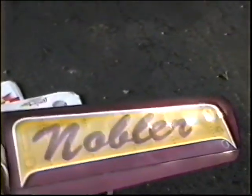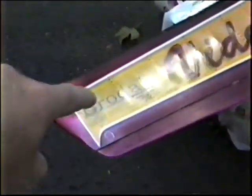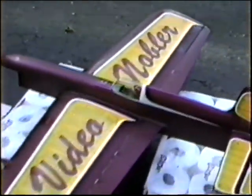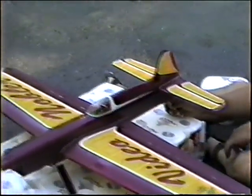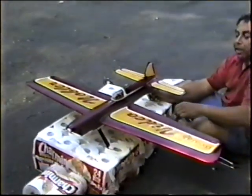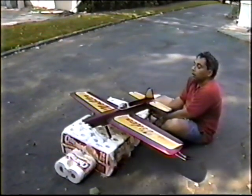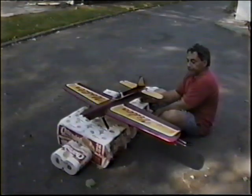Now while this first coat is drying, Kenny's being a human stooge, so to speak. Hey, nice head. Anyway, you can see what we did. We have only the cap strips and only the letters and only the edges done with a coat of clear. We want this to dry for a good 15, 20 minutes. Is it dry to the touch yet? Getting there. Well, let it dry to the touch and then we'll get a little more in it. Just repeat that two or three times. Let each coat dry a little bit.